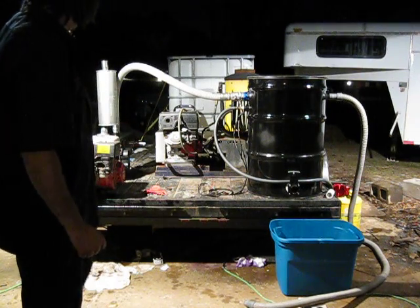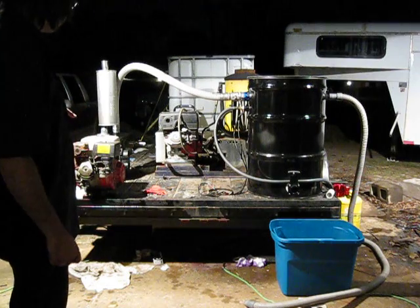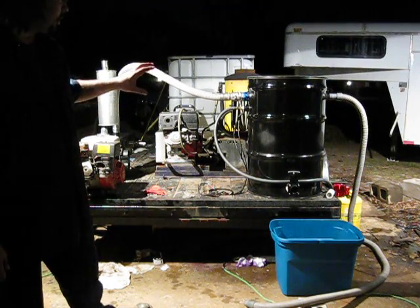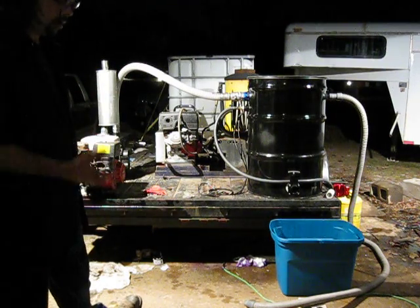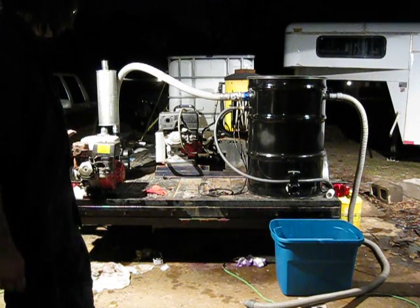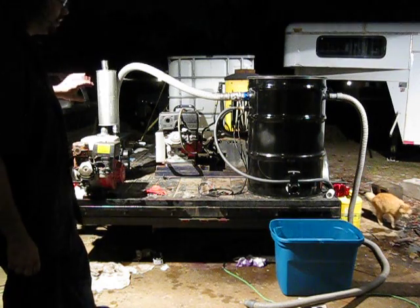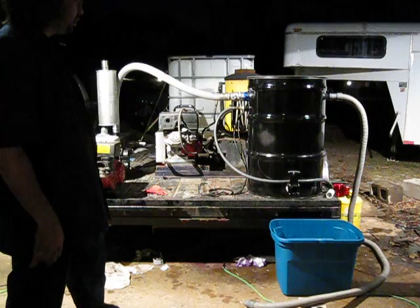I've got a Roots 33 URAI T-Series blower that is used as the vacuum source. So you pull the vacuum on the drum, which is used to suck the water up off the ground through a vacuum berm or a surface cleaner. It's powered by a 9-horse Honda. It's belt driven, with a muffler on it, standard truck muffler, nothing fancy. This one came off of, I think, a small Ford 6-cylinder truck.